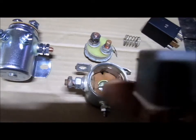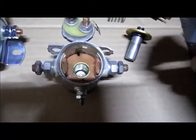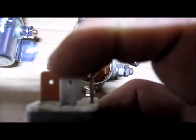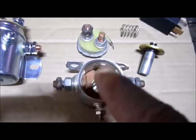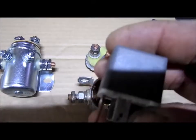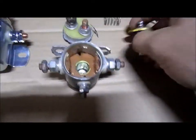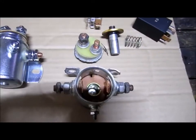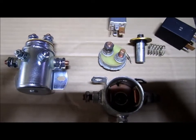You can see how big the posts are on this little relay — that's because this relay is pretty high in amperage. It's 40 amps, so 40 amps of current can travel through these two contact points, that's why they're so large. If it was a little 10-amp relay, the contact points would be a lot smaller. But the same idea — all this is doing is magnetizing the coil inside, creating magnetism and a pulling effect, pulling the plunger down which allows a circuit to be open or closed. Thank you for watching, subscribe if you have not.